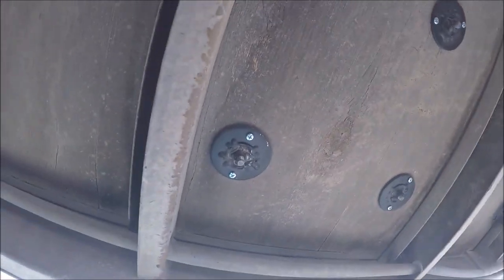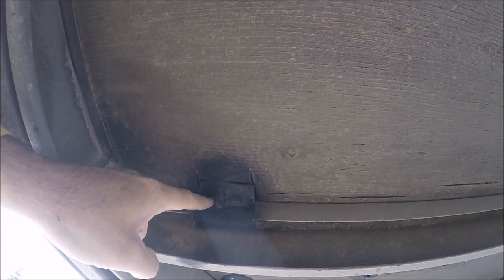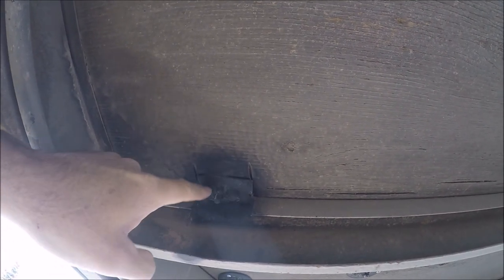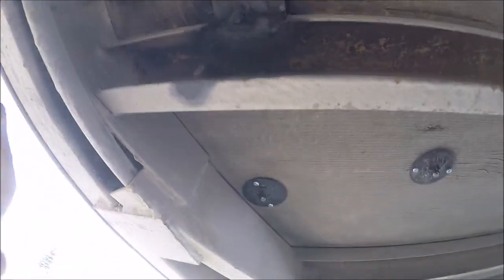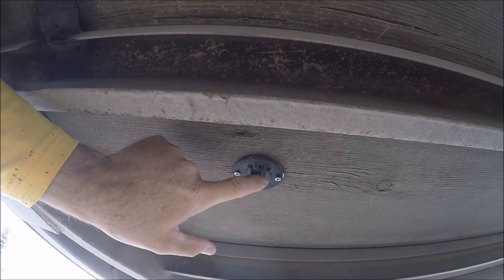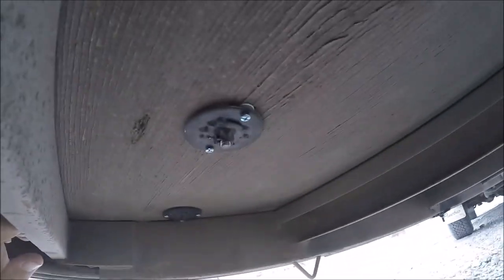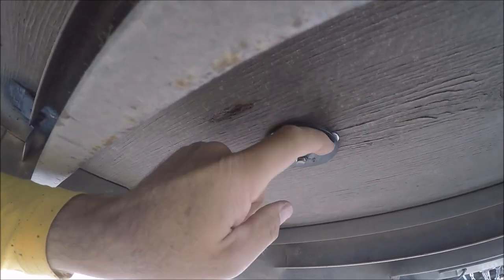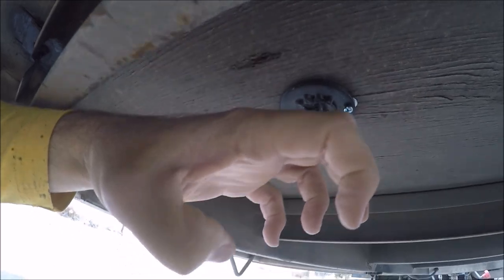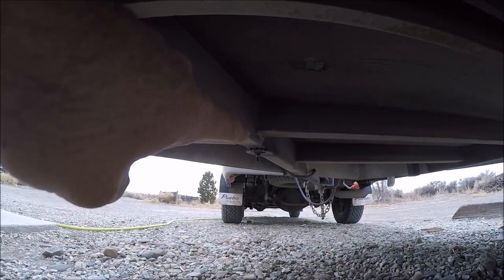Here's three more for this rack. On this one, I had previously cut the frame to put a washer and nut here, so the frame was already cut and I just went ahead and welded a nut to it - that's very strong and sturdy. You can see my screw there from the E-Track. Here's an example of when one of these came out so crooked from welding that one edge was against the wood but the other edge was sticking up high. I just wedged two or three washers in there and ran the screw down - that holds it centered so when you drop the bolt in it threads up straight. There's the one that went all the way through the frame rail - that took a little bit of fabricating.